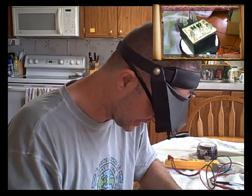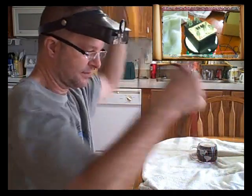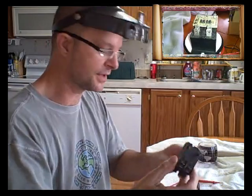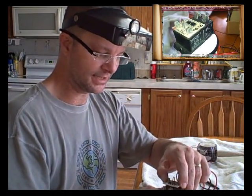I noticed this one is shot — I put the meter on continuity and no matter where I put the probes I don't get anything anywhere. So the contacts are stuck somewhere in the middle. I haven't taken a hammer to it yet — I might cut it open for fun later. Anyway, something to watch out for; I thought you might be interested in seeing one of these.